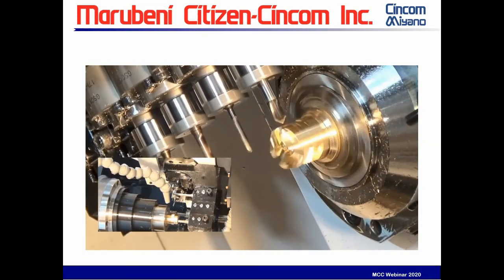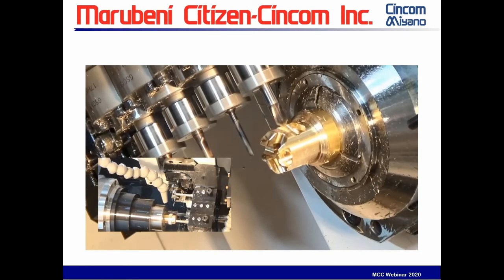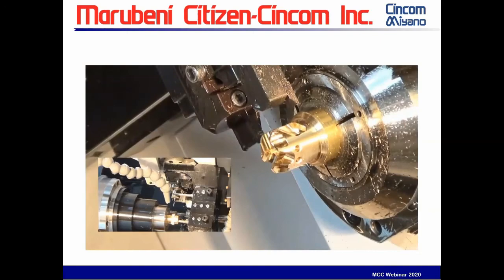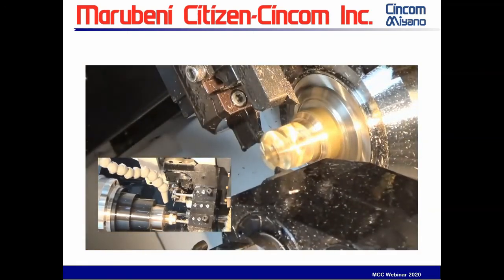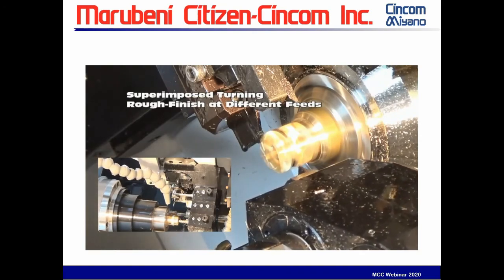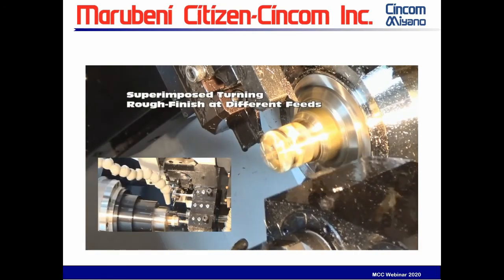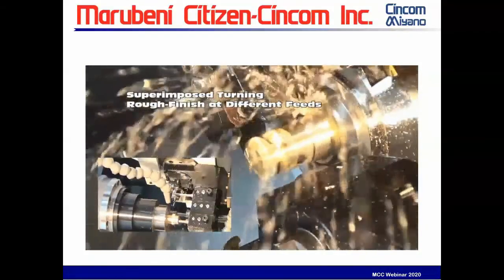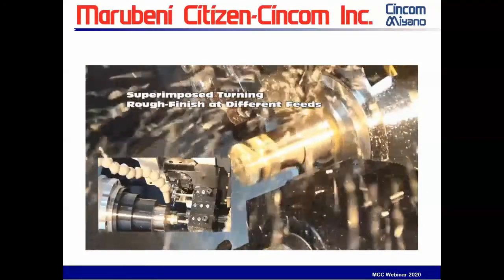As you can see from this, it's very complex machining capabilities of this machine. Again, we're contouring around the cross pocket feature for chamfering and deburring. We're superimposing different feeds to rough and finish at the same time.